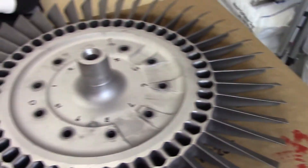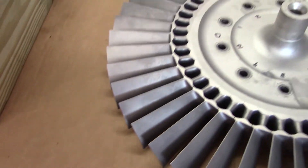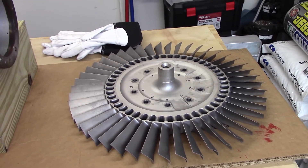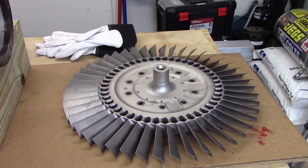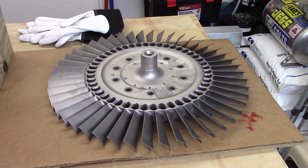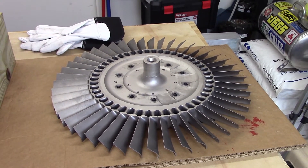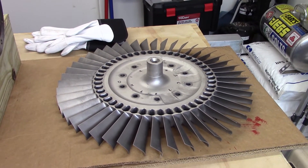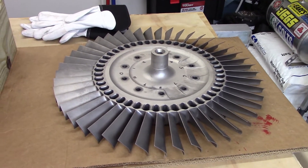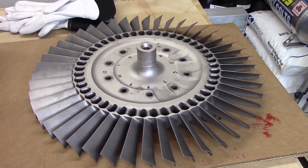This makes reassembly easy and not mixed up. Those bolt dash-numbers matter because Jay could have ground on one of those bolt heads to create a weight between two available weights. That bolt has to go where it goes, so you number it and go with the system. There's the turbine wheel assembly and the precautions involved with it.